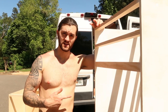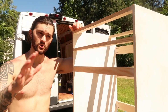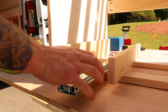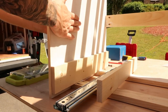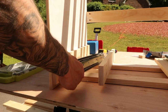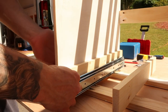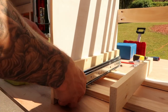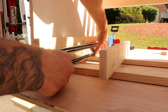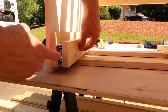We have our vanity here completely structured out. The next step is to work on the drawer slides for our Nature's Head toilet that we're storing here. We kind of started one side to give you the rundown. Here are our heavy duty 20 inch drawer slides. We have the outside of our vanity, and then we mounted this piece of one by four right here from the outside to be the support for this slide. We could have just put it directly on the plywood, but because it's only a half inch I wanted it to be a little stronger. Then for the drawer, we're going to have these one by threes connected to the actual toilet drawer, and that's what will be mounted to the other end of the slide.